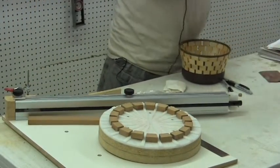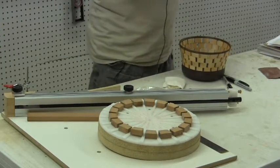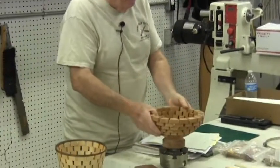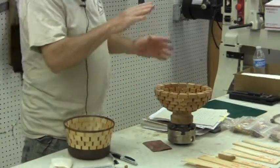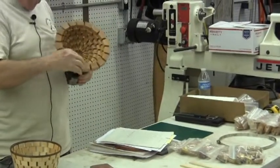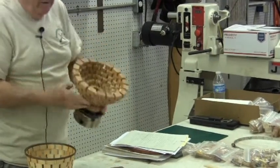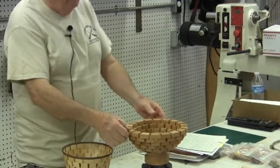This is sitting on the lathe, or I use a press, I don't put these on. So this is on the lathe, spinning, if I can spin it. I take the sanding ring, that's just a disc like this with sandpaper on it, and I hold it against this as this is spinning. This guarantees me that I'm going to have a level surface for the next layer. It looks level, and if I sat this on there now, it probably is good and level.